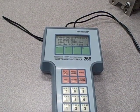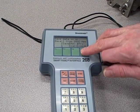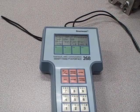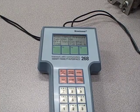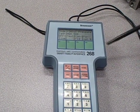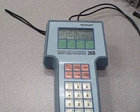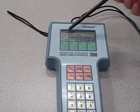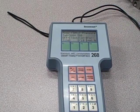If I try proceeding, it does recognize what the transmitter is; however, I may not be able to access all the functions of that transmitter because I don't have the latest device description file. In some cases, if the DD file is so old it won't even talk to the transmitter at all — it won't even be able to tell, for instance, that it's a 3051C pressure transmitter.